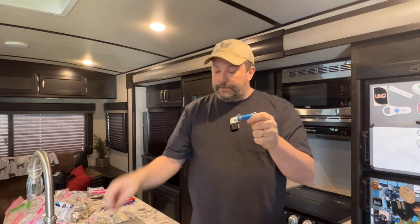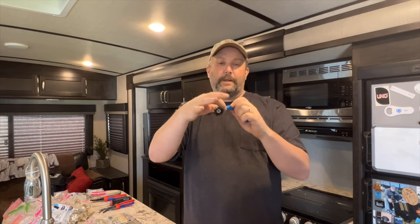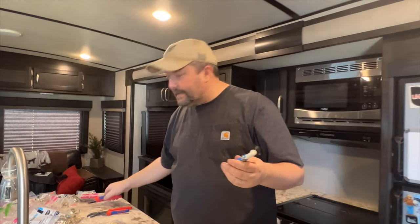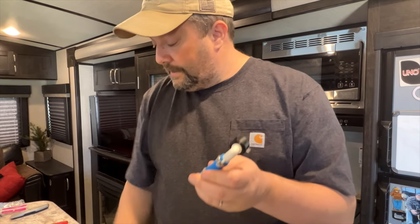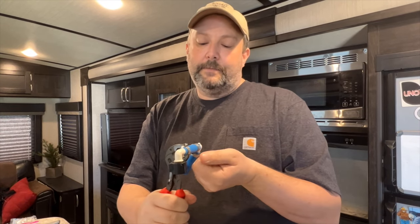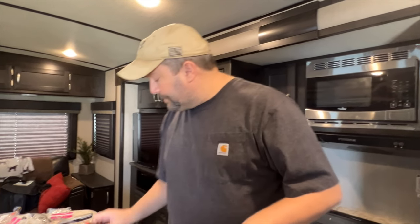You can use the other end of the tool to cut the crimp ring off as well. These rings are really hard to take off and they will cut your fingers — we had a small casualty just shooting this video. Once you cut the ring, the easiest way to take things apart is to either grab the ring with regular cutters and bend it out, or use a screwdriver to bend it out a little. You can hold the fitting with channel locks and kind of peel and roll the ring back as you go. It's kind of a pain — it's easier just to cut it and put a new one on.